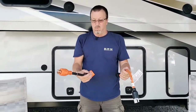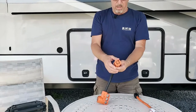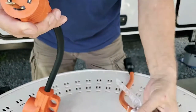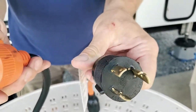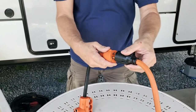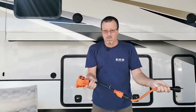These are more susceptible for AC. Here's what's called an L14 — you've got to figure out which kind of pattern you have because they have different patterns. My generator hooks up with this one. I have a Generac 3500, and I need this adapter to adapt to it. So my generator is plugged into the generator outlet, and this actually supplies my 50 amp.